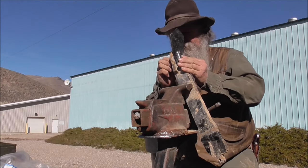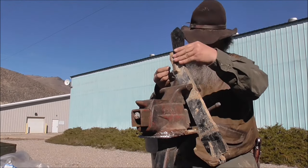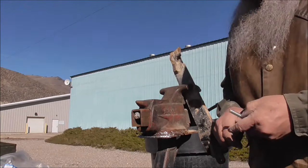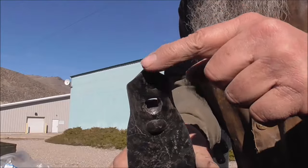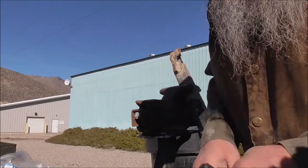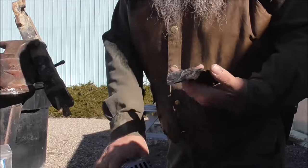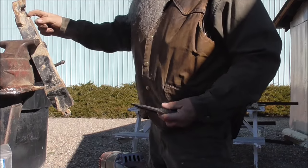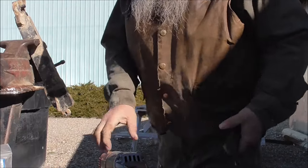These are almost a little too short. These plow teeth — this point here won't work with this; it hits. I've got to take and cut all those off too. It's not that hard to do, but it's just another step that takes more time. What I probably should do is cut this out a little bit more so that the tines fit and I don't have to do this every time I change them.